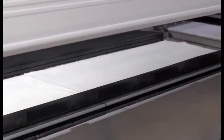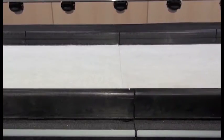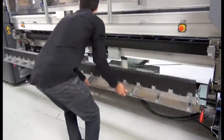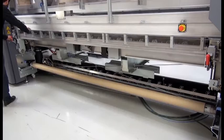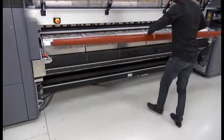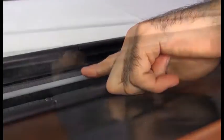Make sure all the ink collector modules are aligned with each other and that there are no gaps between them. Check that the foams fit into the spaces provided for them. Lift the pinch wheel module and close the latches. Place the rolled protector on the curing module. Do not open the curing module yet. Place the tab of the protector into the slot.